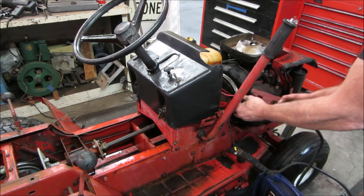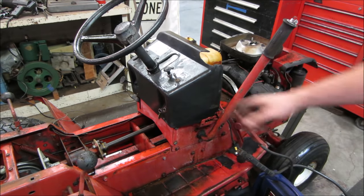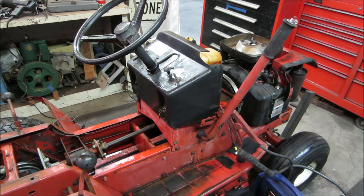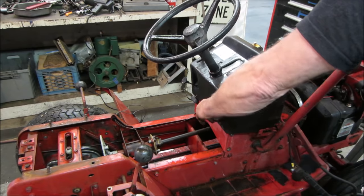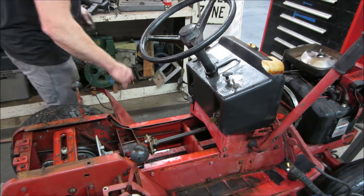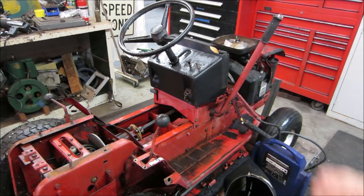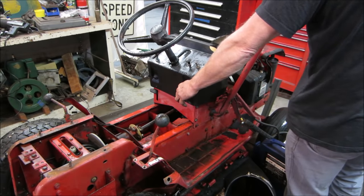I done broke some. Brake pedal is down. I don't know about the seat safety wire switches, maybe. That's in neutral. Transmission's in neutral. The pedal's down. Let's try crossing those seat wires. That's what it is. Let me go make a jumper up for that. Yeah, I jumped the seat wires. Let's see if that took care of it. I would say yes.